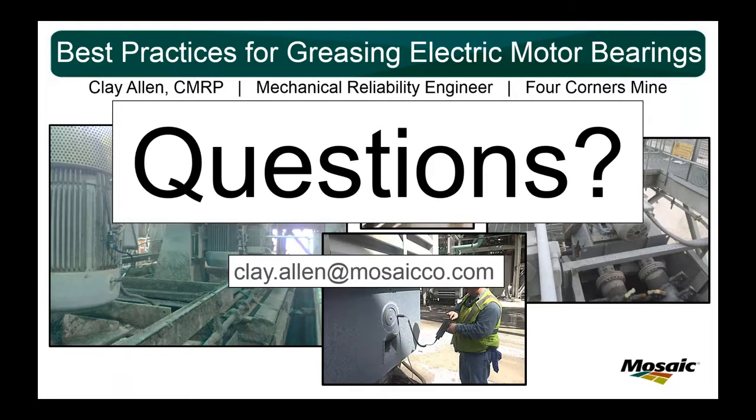First off, did you calibrate your grease guns to ensure consistent amounts of grease? Yes, I did. We have a metallurgical lab on site. They have some nice scales that read out to thousandths of a gram. I have one grease gun that every PM mechanic does their motor greasing with, and I keep it in my office. I loaded up grease in it, and I did 10 shots and weighed it, three sets of 10 shots, and I took an average. That's how I knew exactly how much a stroke would give me, and that's what I put into the software to calculate my grease usage.